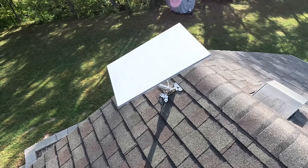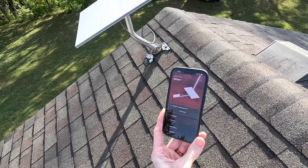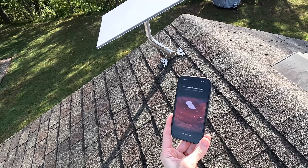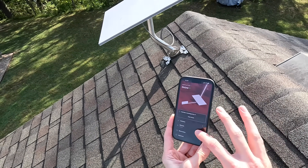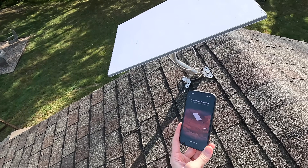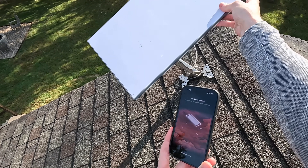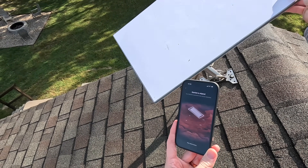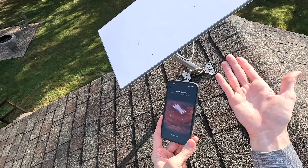I've plugged in my Starlink and everything is powered on and connected. In the Starlink app I have a message that says 'Starlink misaligned by nine degrees.' Before doing the final tighten of the bolts on the pipe adapter, I need to do the alignment procedure for the Gen 3 Starlink. You can tap the 'Align Starlink' button if you see the message, or go into the alignment menu item to get to the same page. All you have to do is go up to your Starlink, have the app open, and just turn your Starlink — the app updates in real time. You have about five to ten degrees of wiggle room; just match the target box and it'll light up saying 'Starlink has aligned.'